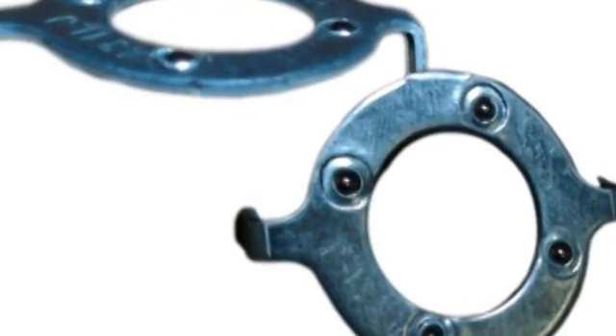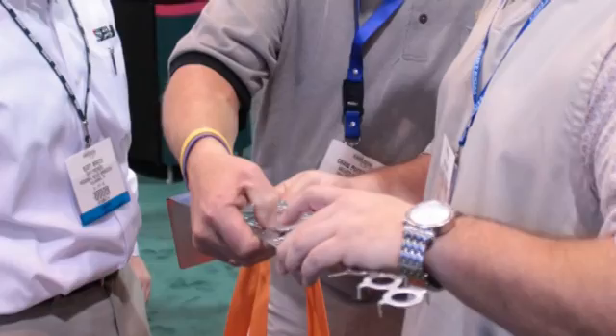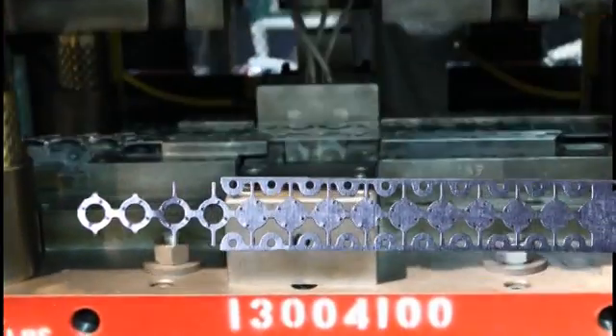The trick and attraction was the engineering behind the ball bearing insertion. To produce the bracket in as few steps as possible, the balls are inserted while the bracket is being stamped. The insertion is accomplished through a 16-stage progressive die where, at about halfway through, the balls are placed and pressed into four pre-tapped holes.